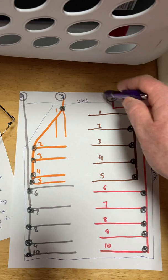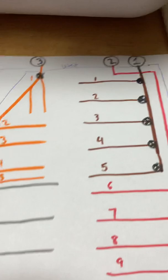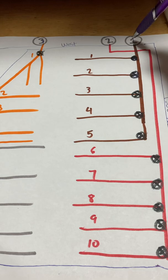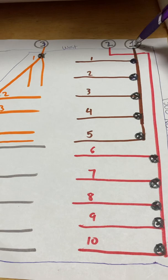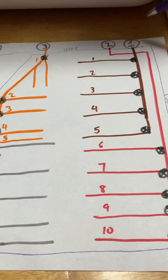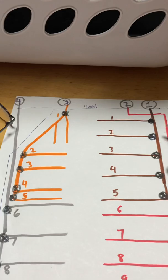At a quarter foot, on each of these lines you've got about 1,500 gallons per hour going through the filter. At that rate of 1,500 gallons, it typically takes a couple hours before the filters get dirty enough to need flushing. At a full half foot with everything going, it's usually every hour you've got to walk down and flush the filters, or they plug and your nozzles stop spraying. So ordering a quarter foot gives me a bit more time between flushes.